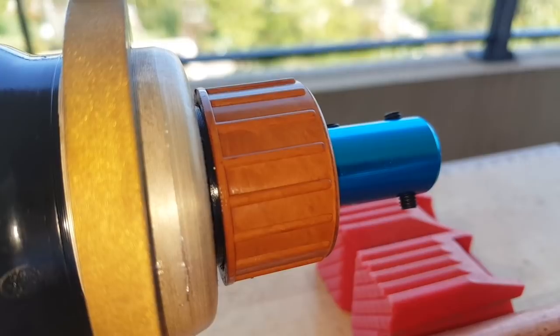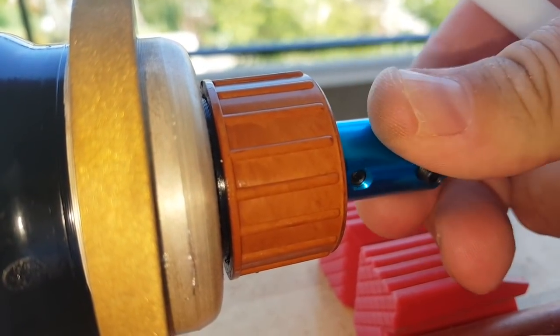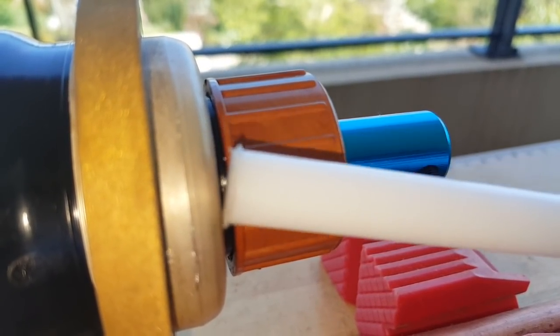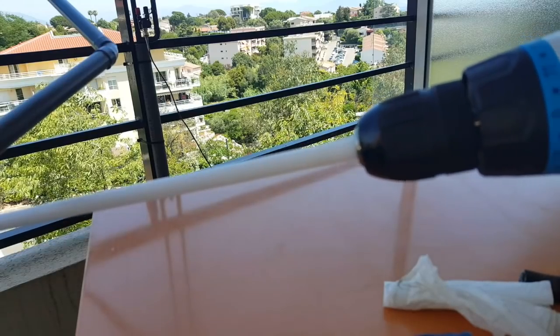The capacitance of your hand is enough to detune the antenna, so you don't want to be turning this by hand. So I got a plastic rod. This was sold to me as a 10 millimeter rod but it's slightly bigger, so I have to turn it down a bit. And this is how to do it.